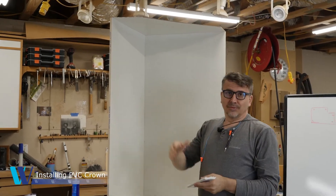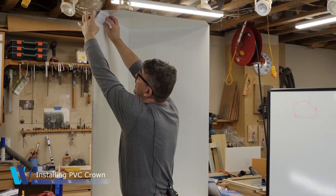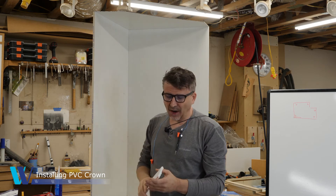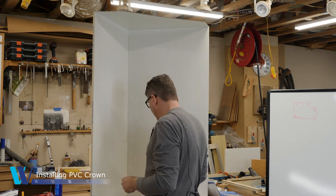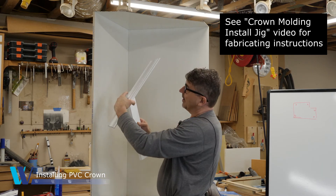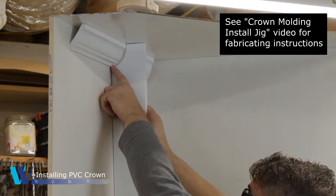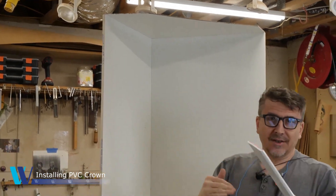There are two techniques to overcome that. One is to place the crown on a table, determine the size of the opening, and create little triangle filler blocks that you put over each stud or framing member. It's quite difficult because of that 52-degree projection angle. But we've got a little device here — we'll show you how to make it — that is really simple to use. Basically, we're measuring down from the ceiling and out from the wall. When we go to install the crown, I usually make a couple of these. If you've got more than one person installing, it holds it at the proper angle so you can secure it, slide it down, secure it there. That ensures when the mating piece goes in, everything's going to be at the same level.